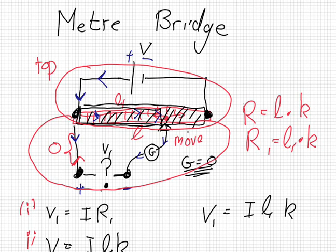Yeah? You know, it actually might help if you think about it like this. That big variable resistor, in your mind you can think of it as two resistors stuck together. So the first resistor is from the start to the middle, and then the piece at the end is like a second resistor. So the first resistor, the battery at the bottom, and the battery at the top, they go through the first resistor. What goes through the second resistor? Only the battery at the top. Because the battery at the bottom, it cuts out before the end.